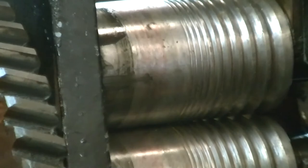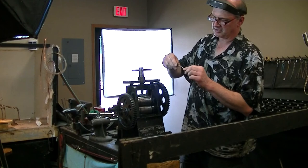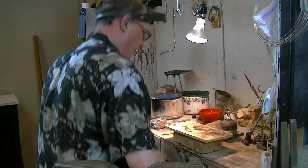Turning this makes the rollers a little closer together every time I turn it. Now that I've made it to the right size, I'm going to start — I've got to heat it up to anneal the metal so it will be soft again.